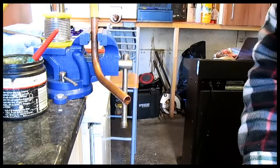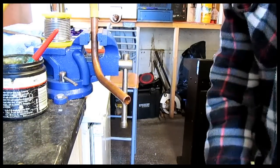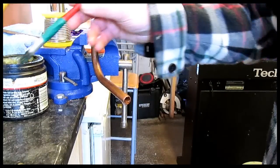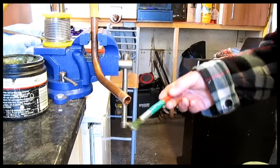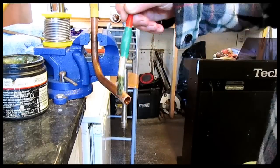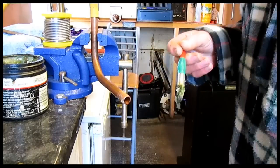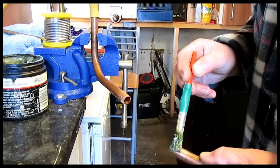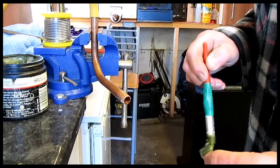This is the sort of situation we're simulating now, where you've got a pipe lower in the system and it's got water constantly running through it — you can't stop it. With water in the pipe it's impossible to solder because it takes away the heat that you're putting on with your lamp; it's just going into the water and dissipating.